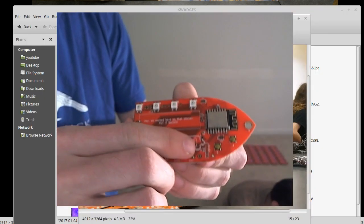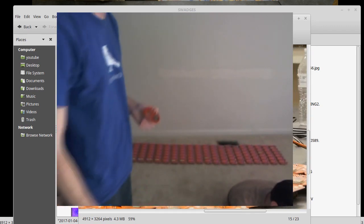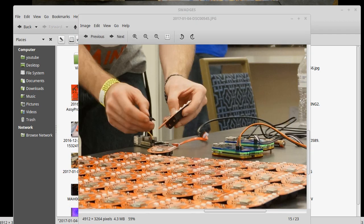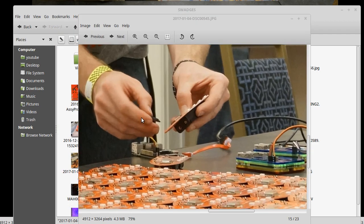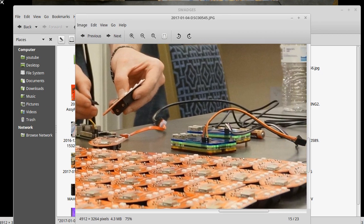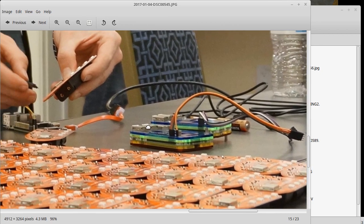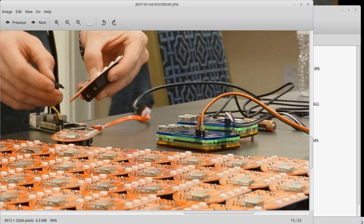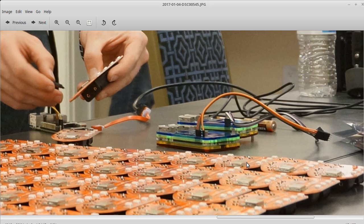There's a little tiny pin header. You take either pogo pins or just short pin strip headers. I had a whole bunch of Raspberry Pis, which have a 3.3-volt serial port on them, and they do 2 megabit quite happily. I just wrote a little Python script that looped forever trying to program whatever is connected. Then we got a couple of volunteers together, and you push the header against the pins, just a little crooked, and it makes contact. The Raspberry Pi would program it, and once it finished, it would do a little rainbow dance on the LEDs, telling you it was done.